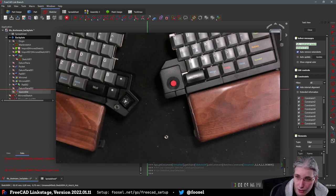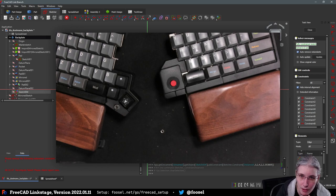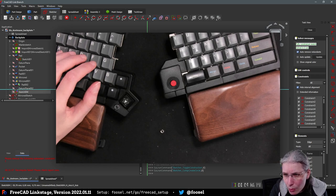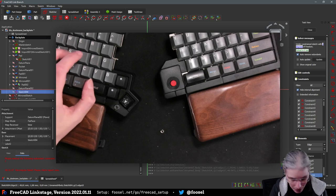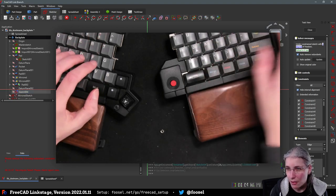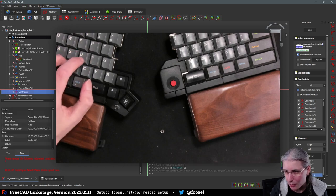Okay, so first of all, we need to... Oh, wait, and also we need a height. 2.37. Oh, you already had that as well. Thank you, Wasser. Yeah, I know that the hole of an M3 bolt is probably 3 millimeters. That was my little brain blurb earlier that I forgot briefly. But yeah, so we are going to throw in two holes here, or two circles, one here, both of them equally distanced from each other, both of them with a radius of, yes, actually 3.5. Ooh, that's big. Wait, not radius 3.5, diameter 3.5. That was my mistake here.